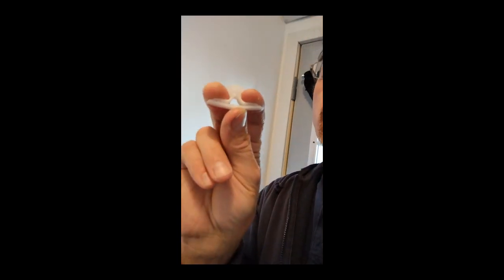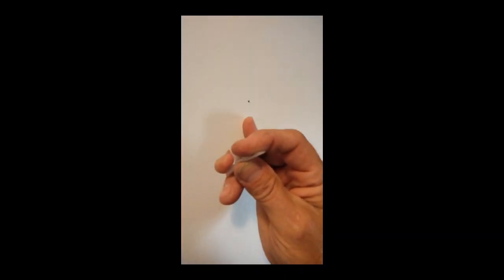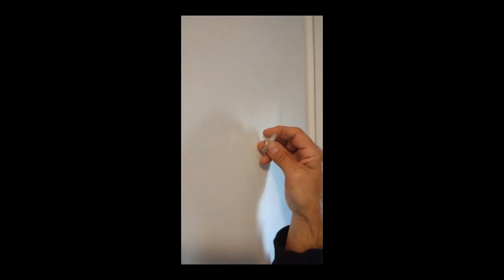So what we do, this requires a 5/16 inch drill bit in order to sink this in. I've already got my spots marked. I measured on the wall. Here, there, and right there. I just have to drill a 5/16 inch hole in each one of these spots, and then I can plug these anchors in and then mount the rack to the wall. So without further ado, I'm going to pause and then turn this around.